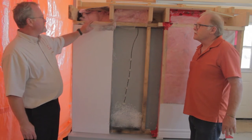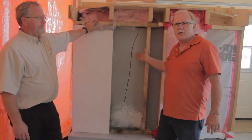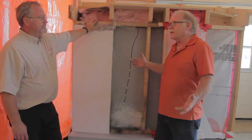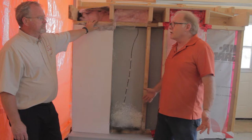Do you test the systems afterwards with a garden hose? Yes we do. We would flood the outside of the foundation approximately an hour after we've injected, and this tells us if we are successful. At this point I can say it's easily a 98 to 99% success rate.